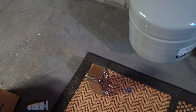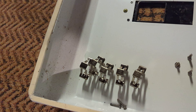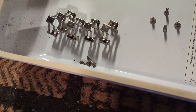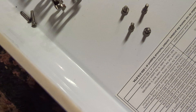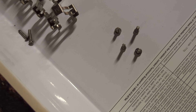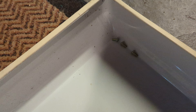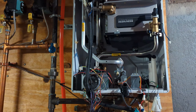We're going to install the new one. To recap, here's basically what I removed: five clips, the cold inlet screws, four screws for the DHW outlet elbow, and three screws for the computer board — and that's it. Happy hunting guys, take care.